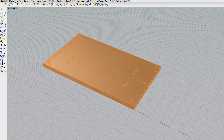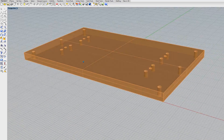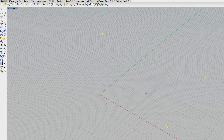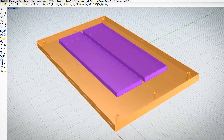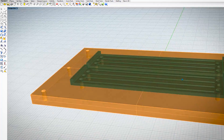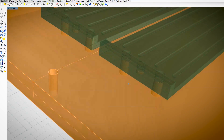What you're looking at right now is the fixture board, or the pencil jig. When we get to the real video, you'll notice that this is made out of particle board. Most of the holes you see in this board are for registration dowels. Those little yellow circles are the locations for the dowels that are going to go into the spoil board. Those purple shapes represent the split boards that we just got done with on the bandsaw — they're now ready to be machined down to the proper thickness. The models depicted in green are at the second stage of machining, where the grooves are there ready for the graphite to go in. We've got registration holes and are ready for a graphite sandwich.